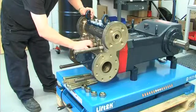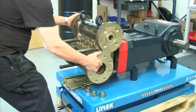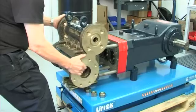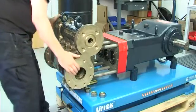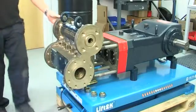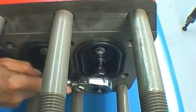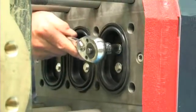After removing the remaining four nuts from the manifold studs, the complete manifold can be removed by carefully sliding it along the extender studs. The manifold assembly weighs over 90 kilos — 200 pounds — yet it is easy to maneuver on the extended studs. Sliding the manifold away gives access to the diaphragms.